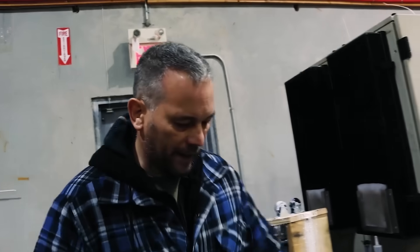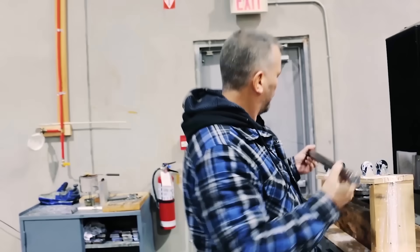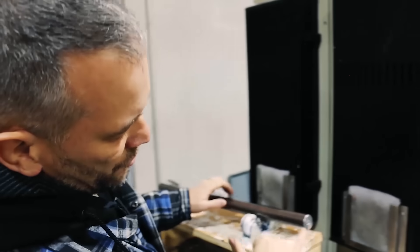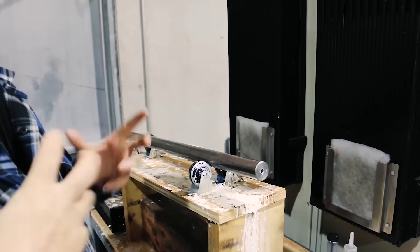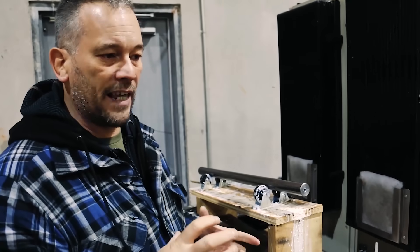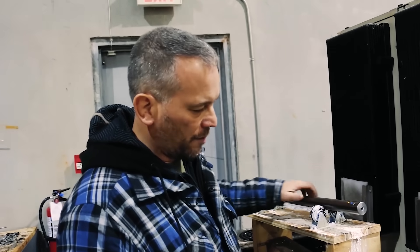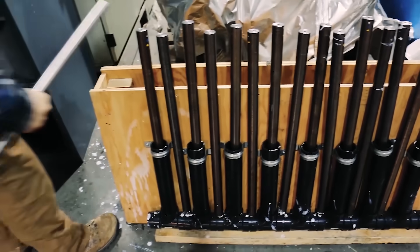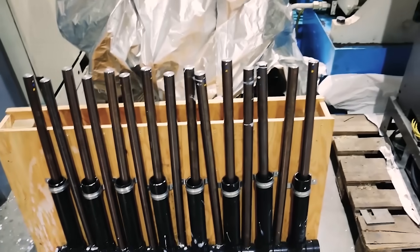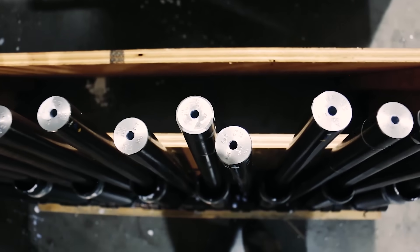This is where we lube up the barrels before they get the buttons pulled. We take our unprofiled blank, put it on the machine, inject a bunch of soap into the barrel, and rotate it to make sure the entire bore is covered on the inside. The soap is actually heated up to a certain temperature, then injected — it becomes a liquid, kind of like wax almost. Once we're sure the bore is completely covered, it goes on this apparatus to dry. The lube can't actually be wet; it has to be dry when we pull the button through. If there's any moisture in the lube, it actually causes more problems.